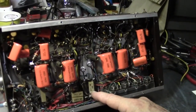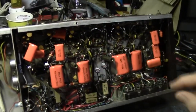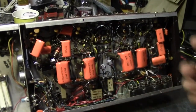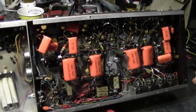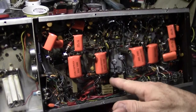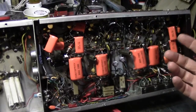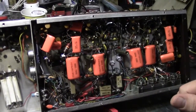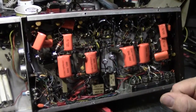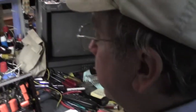I now have to go find a 50-ohm 5-watt resistor and another capacitor, replace them, and see if I've got a bias issue or a bad socket causing that channel to pull excessive current — enough to blow that resistor. This resistor has been changed before, so this obviously isn't the first time this has happened. But at least it's been well cared for — somebody did a nice job recapping it. So it's going to be a work in progress, but that was my first stop in the diagnosis: a shorted capacitor and an open resistor.